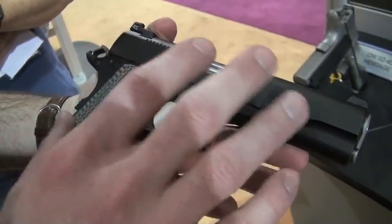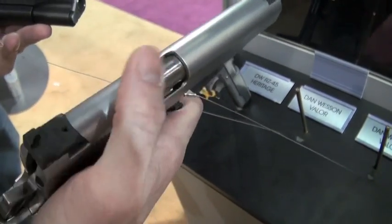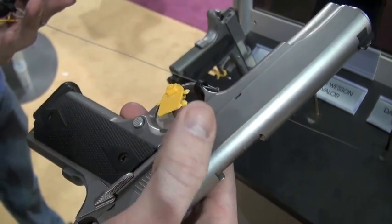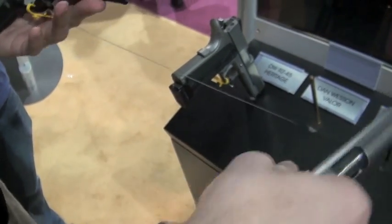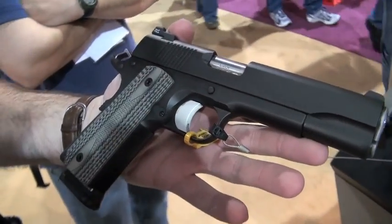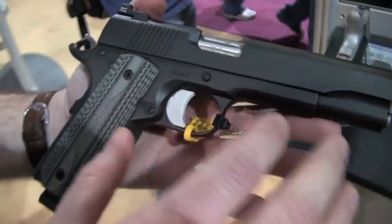It's actually not. It starts life as a stainless steel gun, just like this one right here. Everything in it, frame, slide, barrels, is 416 stainless, all the parts 416, with the exception of the slide stops, which should be 420 because they have to be stronger. The finish on it is our Duty Treat finish, and it's molecularly bonded to the steel itself. No other company that I know of is doing that with 1911s. Most everybody's doing a spray-on, bake-on paint finish.